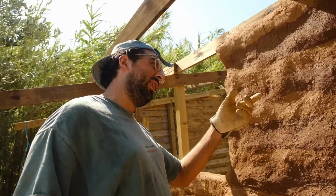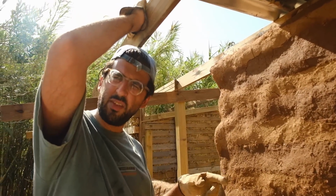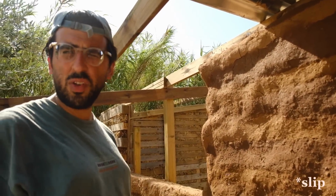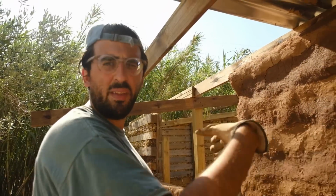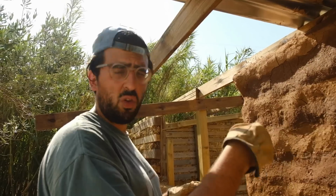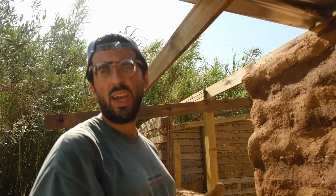So this here, for example, we took from one of the Miguel Elliott videos, I think, on YouTube. Basically what they do is they have what they call slip, which is just clay and water, very, very runny, and you paint with that. And then while it's wet, you apply. So you paint onto the straw? Yeah, you paint the straw and the wood. And then you put the mud or the cob on top of that, and it helps it stick.